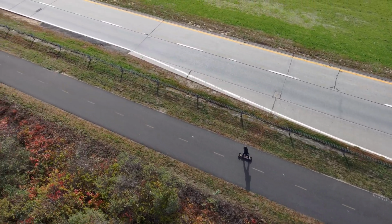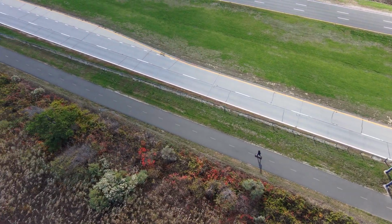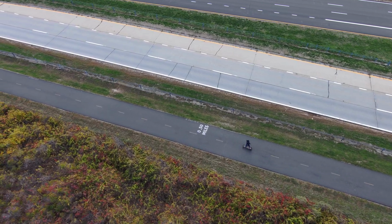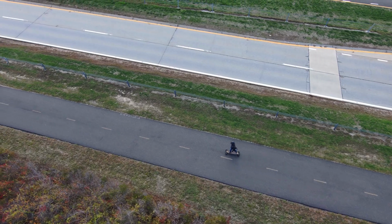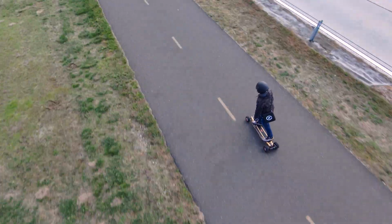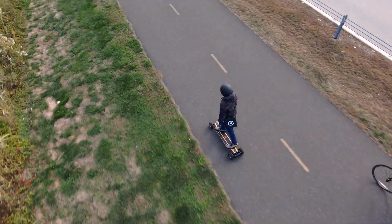What this means in use is nowhere near as large as you would assume it to be. In applications like an electric skateboard with so few cells in parallel, the amount of actual delivered energy or delivered capacity of a battery is well below its rated number anyway. Plus, there are nuances to be found along the way in terms of pack construction, the resistance of the conductors used between the groups, and also the implementation of that battery alongside an ESC and how, when, and why current is drawn. It's these things that end up giving you the actual range of any particular device, and those numbers that are on spec sheets and data sheets and marketing materials don't give you anything like a complete picture. So that being said, what the hell does all this mean? The reduced drag of this gear drive in conjunction with the 40T cells in this battery gave me pretty much the exact same range as I got on the original Hurricane with the P42A cells and the belt drive.